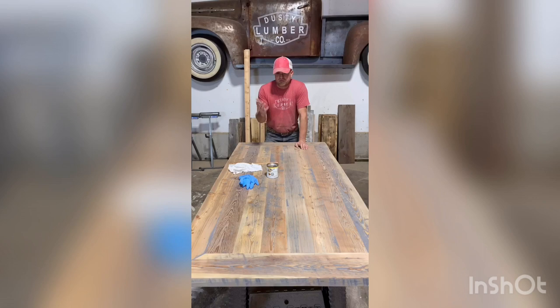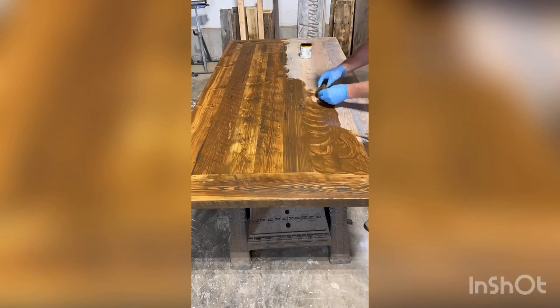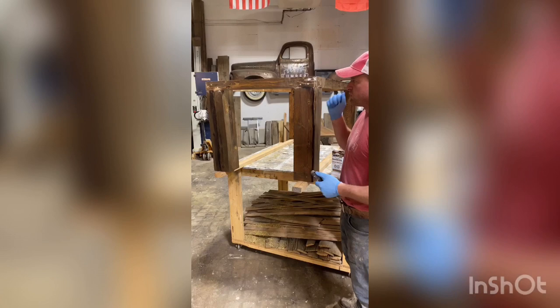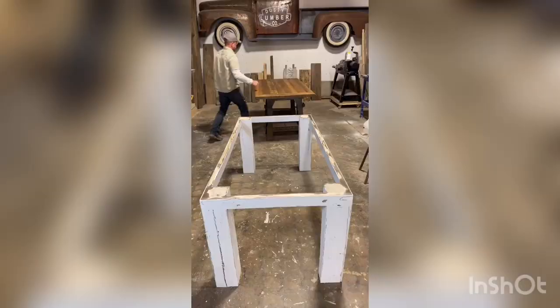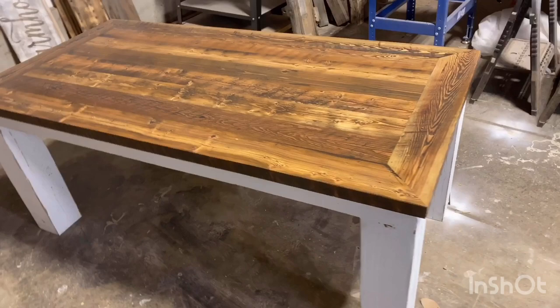I'm going to use the Osmo 3166 stain — it's a wax-on, wax-off proposition. We'll rub it through the entire thing and then wipe off the excess. It goes on nice and then we put some top coats on and the top is finished. I've already put black walnut Danish oil on the base, and now it's time for some paint — we'll brush it on, let it dry, and then sand it off to make it look a little distressed. I've rubbed two more layers of Osmo Matte Top Finish on this table, and it is done and ready to go.